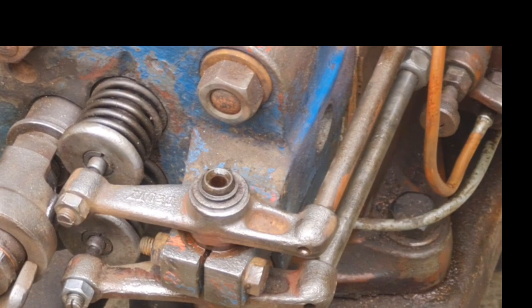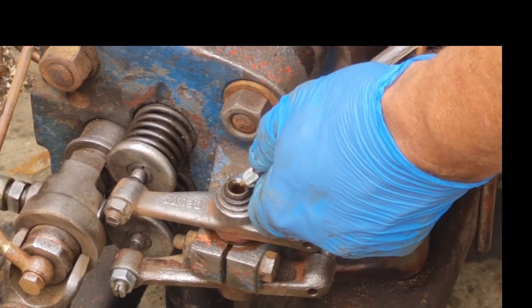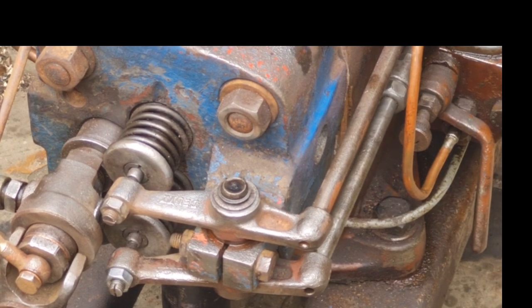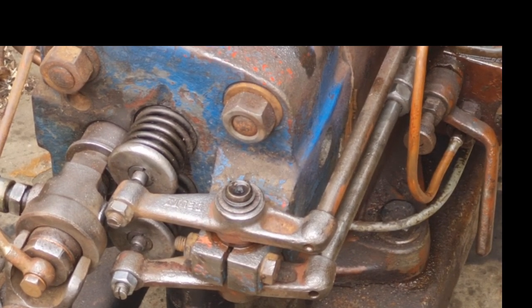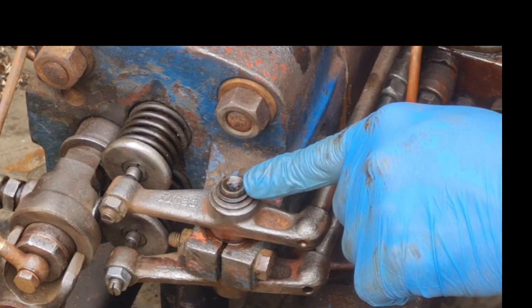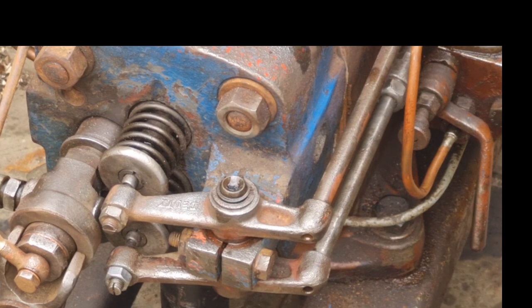One nice little feature I did notice yesterday - you may have noticed I've cleaned these rockers up. You fill this little bit in the end of this rocker up with oil, and you'll notice that runs down and oils them rockers. That's running away, look. I did that three times last night and it starts seeping out all around these rockers - now that's all oiled on the bottom of that shaft. So every day, before you start the old girl, you just squeeze him full of oil and that oils this whole shaft. Isn't that lovely. Absolutely lovely. That was all I wanted to show you today guys.